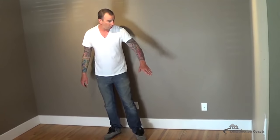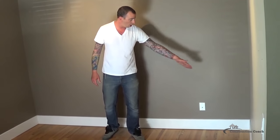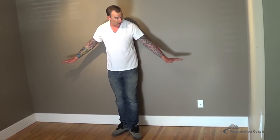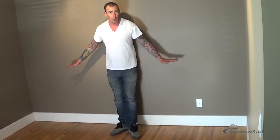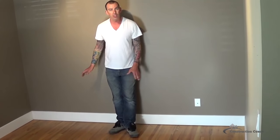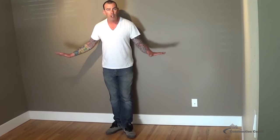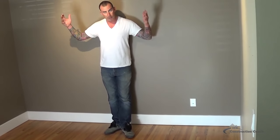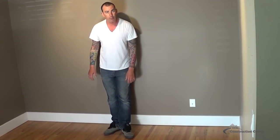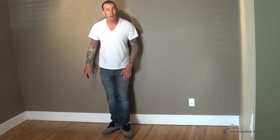We're going to come in here, use our utility knife to cut the top of the baseboard away from the drywall, removing that out, bring our plywood base in here and level it and secure it. Then proceed with installing the base cabinets atop and then the rest of the building up to the ceiling. So I'm going to grab my utility knife and a pry bar, get these baseboards removed, set this base in, and go from there.